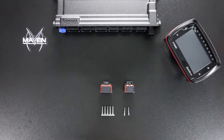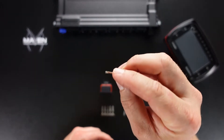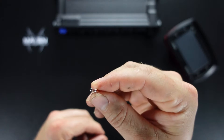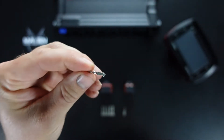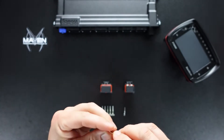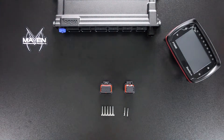These connectors have a stamp type terminal and we'll go through how to do that. This is a double crimp style with a very small terminal opening on the side there to slide into the receptacle. These come in two sizes: one is for 20 and 22 gauge wire, and one is for 16 to 18 gauge wire. Just make sure you're using the correct one — they do look very similar and you have to look pretty close to see which one is larger.